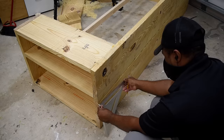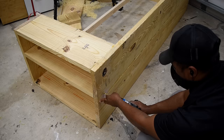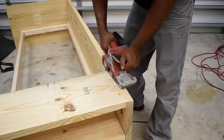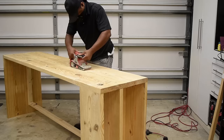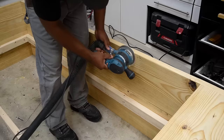After removing the clamp everything felt solid, but I added a few screws on the back side of the sofa to play it safe. If you plan to build one and want the back to be exposed, go the route of using dowels and you won't have to worry about plugging holes. When dealing with rough lumber you're not only going to deal with rough knots but some of those knots have sap in them and the lumber isn't even the same size, so you're going to go through a decent amount of sandpaper. The best part is these lumber are cheap and keep the cost down — you just have to put in a bit more work to clean them up.